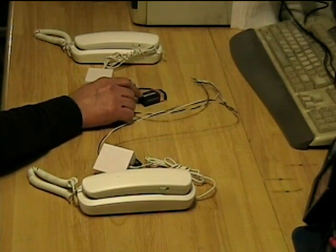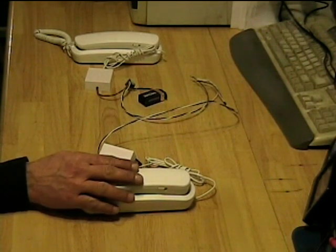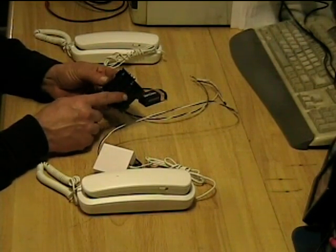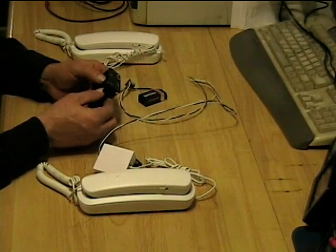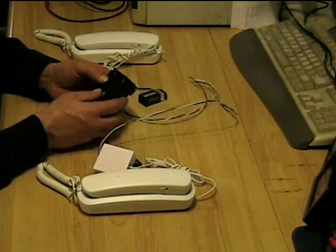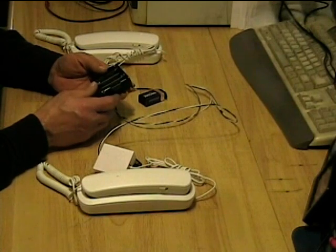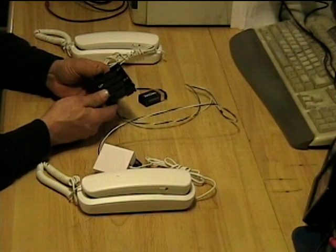On this arrangement, with an initial draw of about 28 milliamps, you're going to last a dozen hours on a 9 volt battery and still have good volume. If you want to drain the batteries completely dead, you might get as much as 20 hours, although the volume will drop. If you want longer life, you can get a holder that holds double-A cells — one that holds six double-A cells gives you nine volts. If you're running a long line with a lot of resistance, like trying to go a mile, you'd probably want to up the voltage.